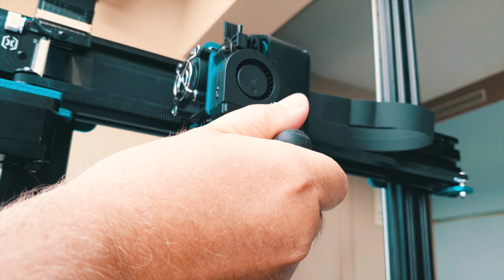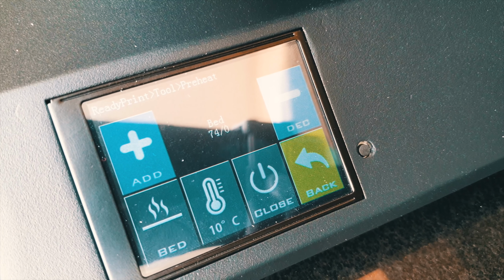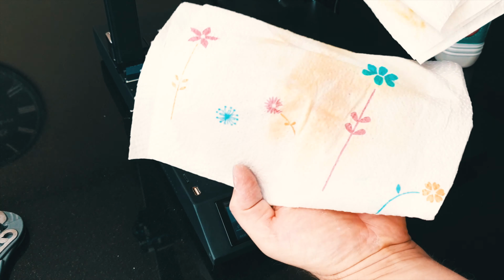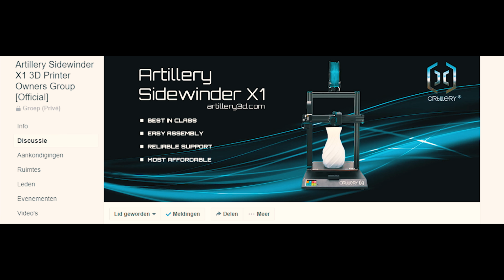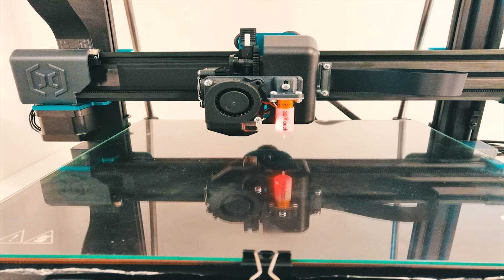While the heated bed heats up very fast, it has its problems. First, it's a glass coated bed that gets to temperature very well in the middle, but the sides, it's a bit random. There's some kind of nasty coating on the bed that needs to be wiped off before use. IPA works just fine. Then last but not least, if you follow the forums on Facebook, everybody has some kind of warping of their bed. This isn't a huge deal and can easily be fixed with mesh bed leveling or this BL Touch.